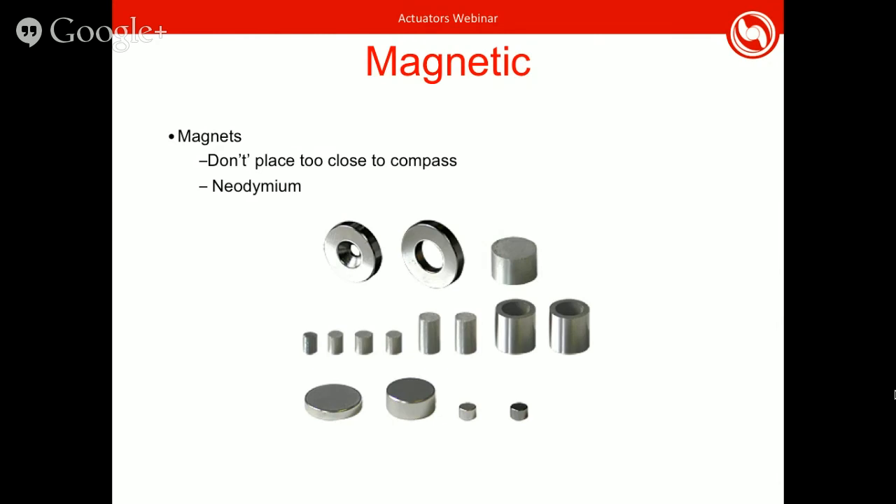You can also use magnets. One thing to note is that magnets will mess with your sensors — that's a problem we've encountered. This is also true with thrusters and brushless motors: if you have them right next to your compass, it will probably mess up the calibration, since motors use magnets and these are very strong magnets compared to the Earth's magnetic field, which is what your compass is measuring. You can always move them farther away, which helps a lot as the magnetic field decreases with distance, or if it's a constant magnetic field it shouldn't mess with it as much.